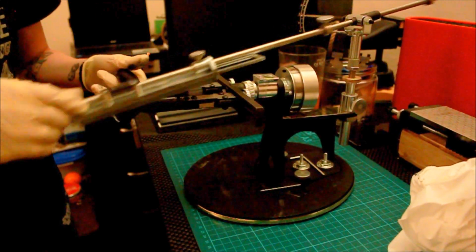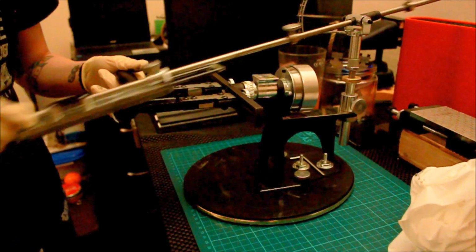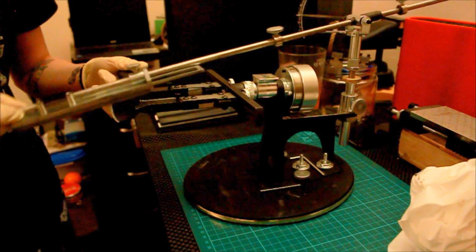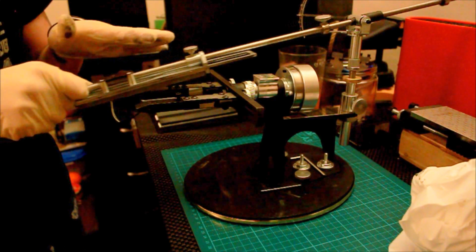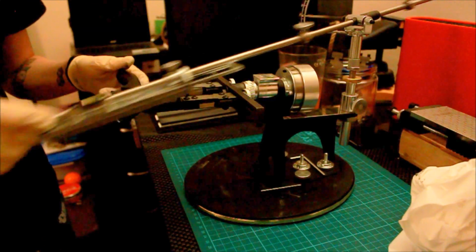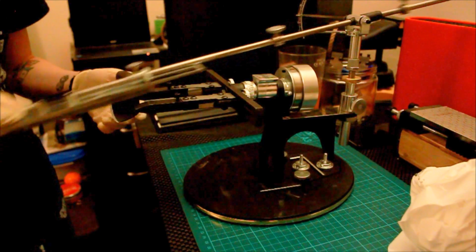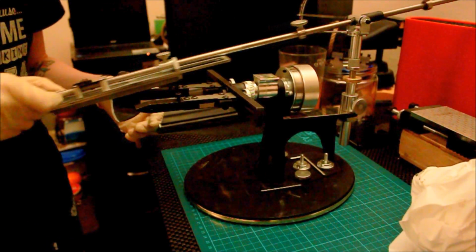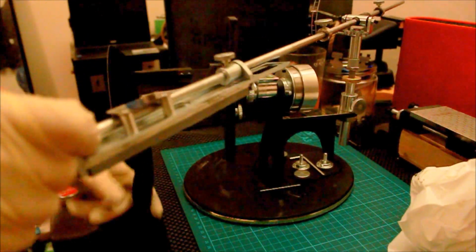I'm just going to work it in circles. Back the other way as well. Make sure that the back edge gets some forwards motion as well as the front edge. When you do it this way and you're coming down on the other side. This stone feels very smooth. And pop that back edge again. Okay, flip the blade round.